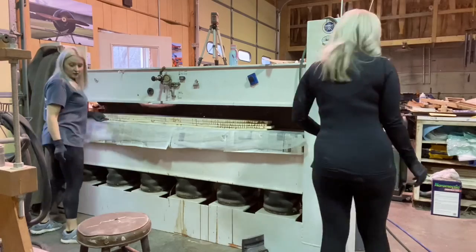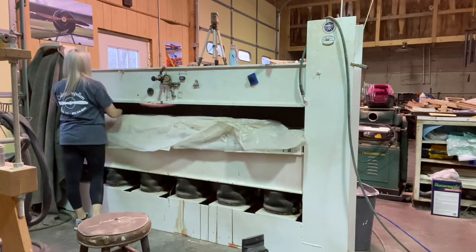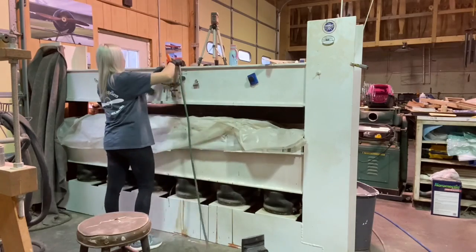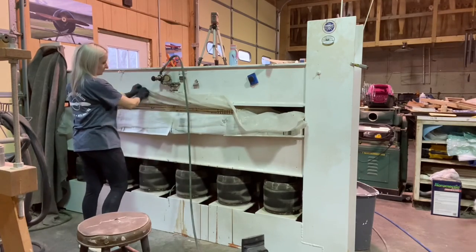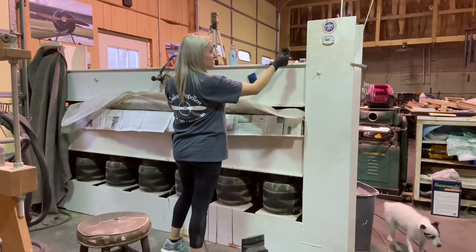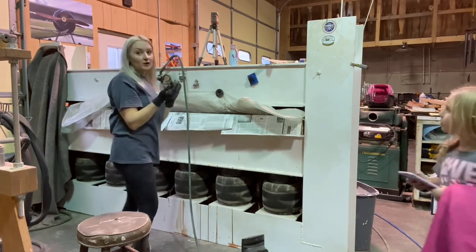There's the actual press — 18-wheeler airbags are what's used to create the pressure. You just stick the air hose on there and you're good to go. When we bought the company the previous owners didn't even use this press — they would just put it in a box and screw it all down. I can't imagine how long that would take. I'm super thankful for that piece of equipment every single day. That wraps up day one of how to glue up a propeller — the next video will be day two.